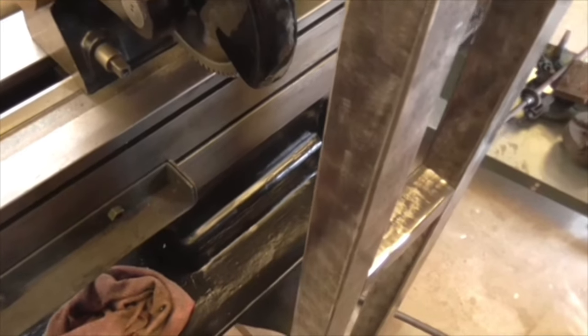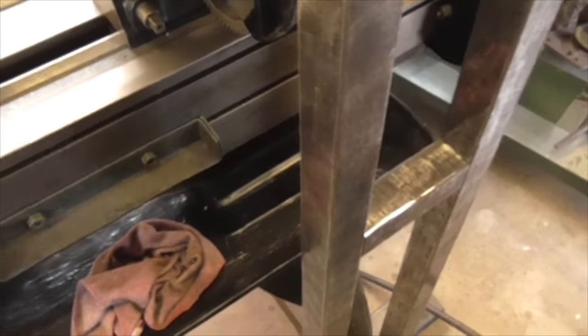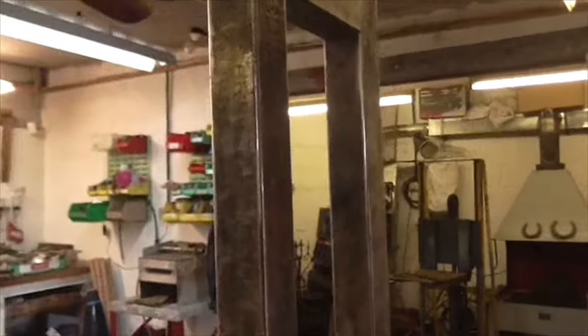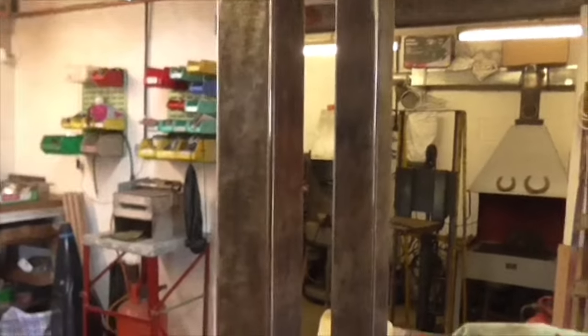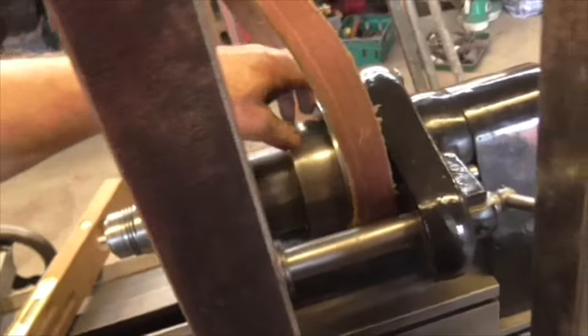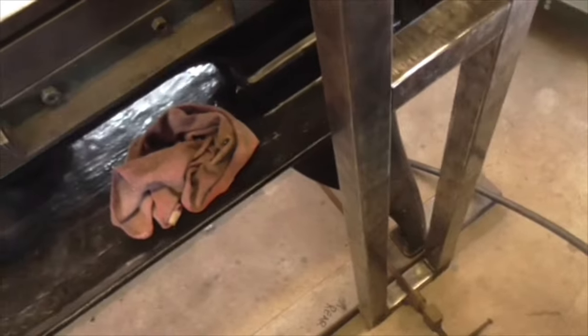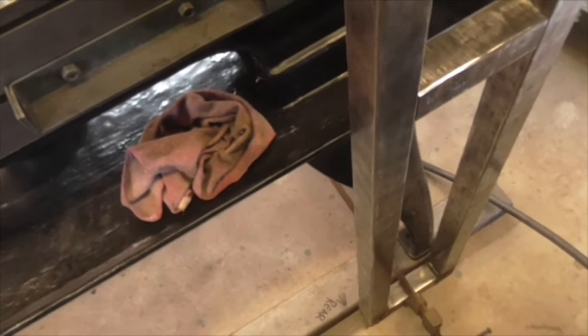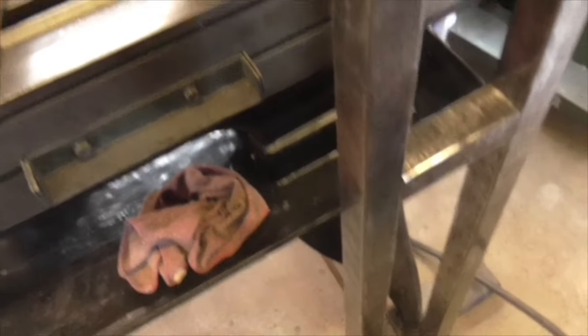in that plane, but I have to now align it to get the pulley alignment correct when it's all assembled. This is as yet height not determined. The first thing to do is to get the horizontal displacement fixed, get the pulleys lined up, and then mark the box section for the two holes to be drilled and tapped. Right? And then onward.